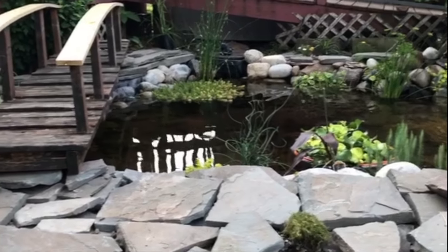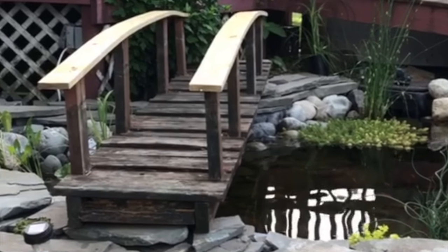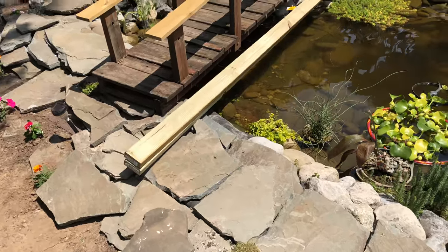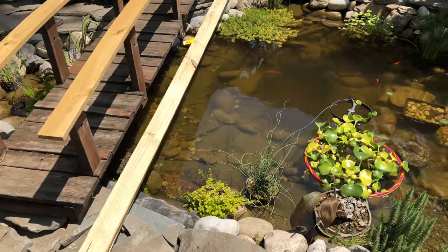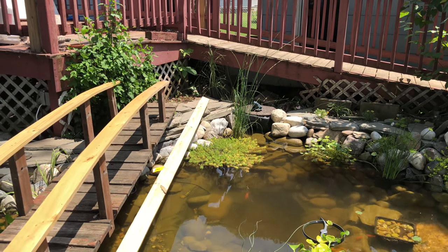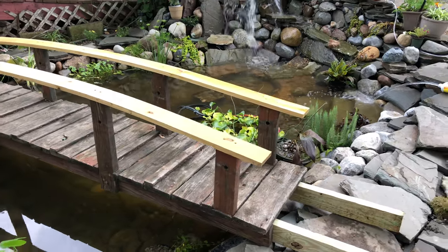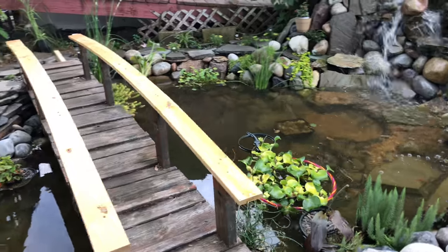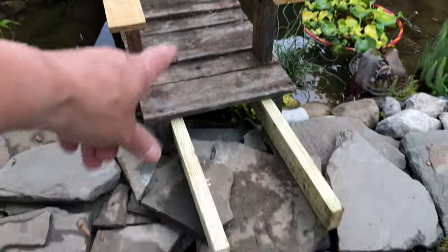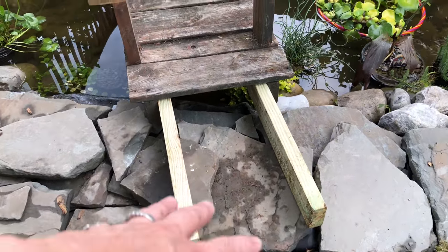They curved some wood to make two new railings. I got two 12-foot two-by-fours because I'm not liking where the pond bridge is sitting. I wanted it over more, so I had to get longer wood and supported that on the inside of the original supports with deck screws. Now we're going to get some one-by-six planks, cut them up so the decking will come out here.